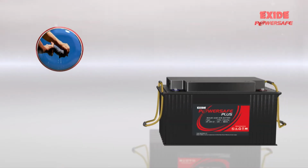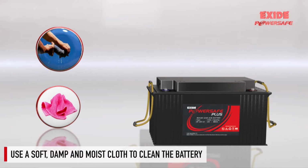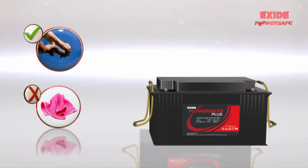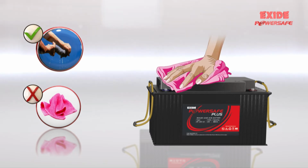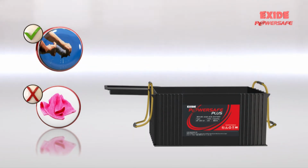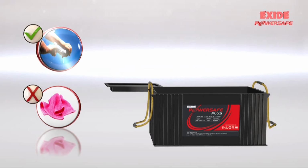While cleaning or checking the VRLA batteries, always use a soft, damp cloth containing adequate moisture. Never use a dry cloth as sparks created by static electricity can ignite hydrogen gas generated from the battery, which could lead to an explosion.